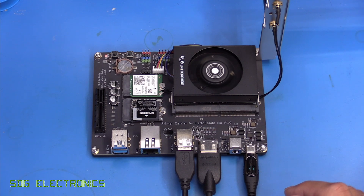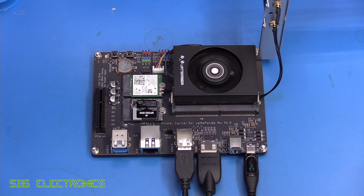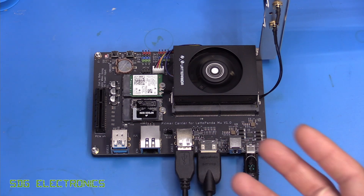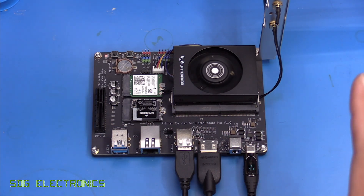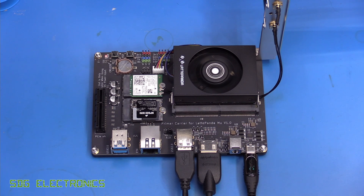There's quite a variety of uses for a small board computer like this one. You might use it as a low power PC — with a reasonable graphics card you'd be able to watch H.265 and H.264 encoded video, browse the web, and do general purpose computing. Its low power draw of five to seven watts and relatively powerful capabilities make it ideal for home automation. You could run Home Assistant with plenty of extra services in the background, and even have a QT front end for graphing. We've now got Ubuntu on here drawing five to seven watts.